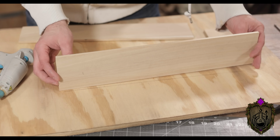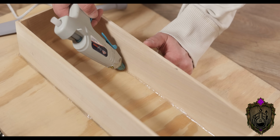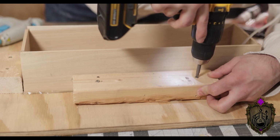But now we're actually set up to make our mold here. I've covered this a bunch of times, but real quick, basically I'm going to end up making a little box to make my mold out of. To do this, I used some 4-inch wide pieces of wood that I hot glued in a roughly box shape to a piece of plywood. I also screwed some scrap boards onto the outsides of that, because I have had occasions where my glue up failed and everything just fell over.